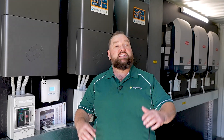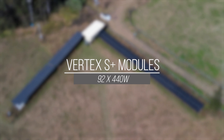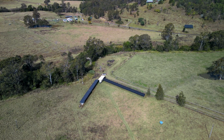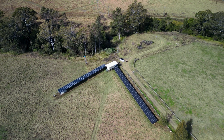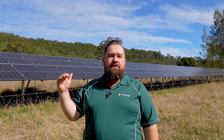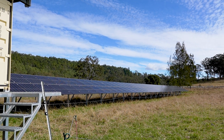This system has a couple of ground mounts — let's go have a look. Behind us we've got a 40 kilowatt ground mount array using Trina Vertex S Plus 440-watt N-type modules on a Clenergy Solar Terrace 2 structure. A specific challenge here is that we're standing on a flood plain — last time it flooded there was at least 1.2 meters depth of water, so this array had to be a minimum of 1.2 meters high. We worked with Clenergy for specific site engineering, had a soil test done, and had specifically made posts that meet the height requirement with install distances between posts a bit smaller than usual.